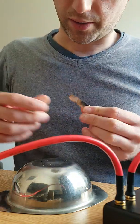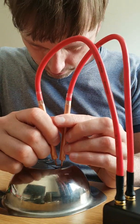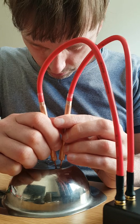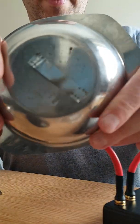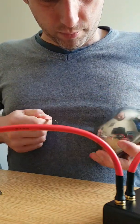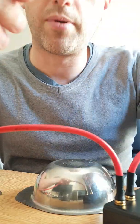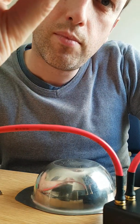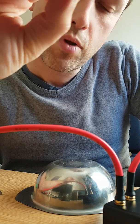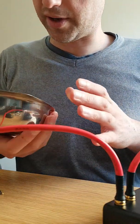Let's try 6 out of 6 power with this 0.12mm strip. That's what I would say satisfactory — every single strip has a hole in them from every single weld. So in my opinion, 0.12mm at full power is good, based on this kind of testing anyway.